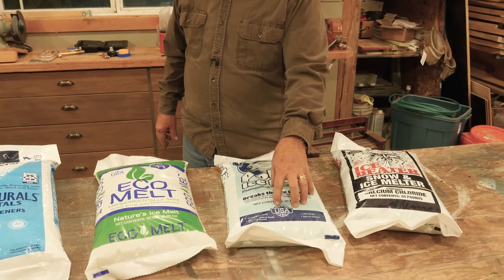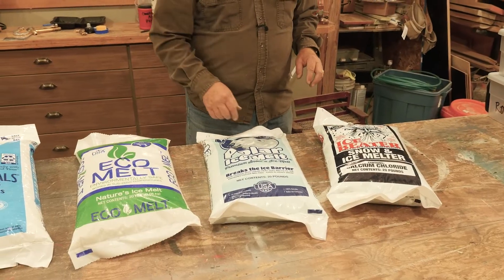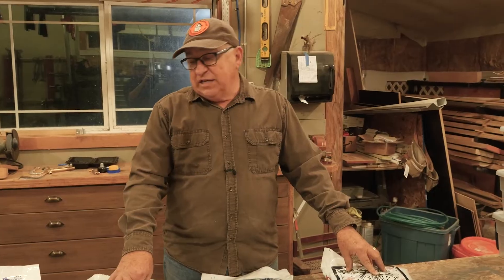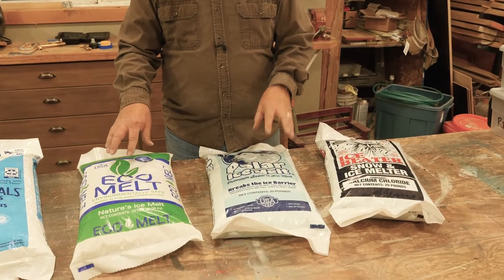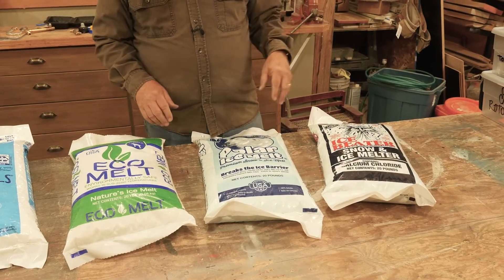The other important thing about these products is that they don't tend to toxify the soil adjacent to the driveway or sidewalk as fast as standard salt does. You've probably seen this before — you heavily salted or over-salted an area on your garage apron or sidewalk and then found that the adjacent grass had trouble growing the following season, or plants struggled or died off. That's likely due to the soil becoming very salty and creating conditions that plants cannot thrive in. There's less risk of that happening with these products because you apply the correct amount, which does the job without putting a lot of material into the soil.